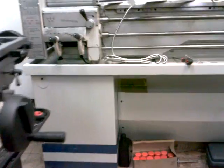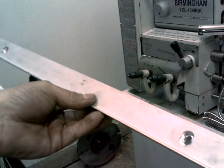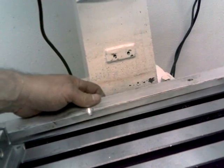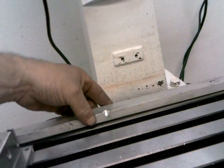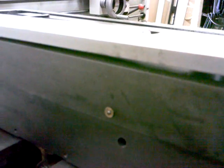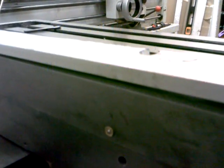The next thing I wanted to show you is this piece right here, which is the mounting bracket for the scale itself. This bracket bolts on the back of the table like this. Now if you'll notice, I milled a hole in the back of that bracket. I had to do that because where that bracket is going on there, I've got one of these ball-type oilers right there on the back of the table. I hate covering it up, but I don't have a choice — I'm just going to have to oil it in other ways and make sure that I do so.